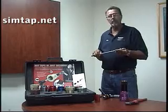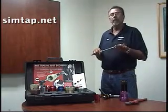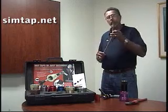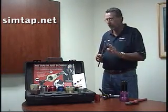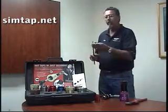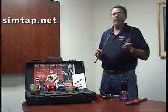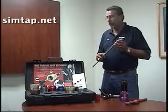So if your tap is taking you more than two minutes, something's wrong. Retract it back, shut off the corp, pull out the shaft and investigate to see what's wrong. You'll either have a dull shell cutter or you'll have a drill bit that's spinning free. Other than that, it's that simple to make a hot tap with the SimTap.